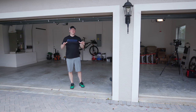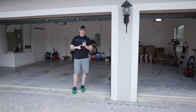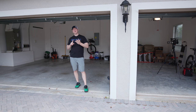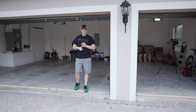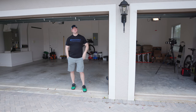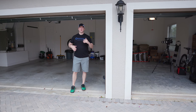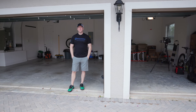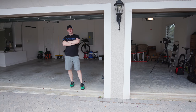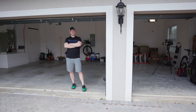Today's video, we're going to get into relocation of the air conditioner — the air handler for the main house — as well as installation of a mini split. We talked about some different options on how to set it up. We're doing an 18,000 BTU Mitsubishi mini split. I'm going to have to do some insulation in here as well as a follow-up. But today my friends from Kalos are coming to help with the relocation and installation.